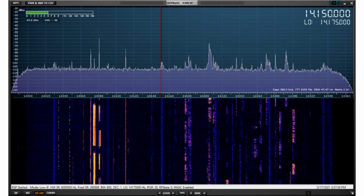Now let's take a band of frequencies. This is the big conceptual leap here, okay? Rather than take a single channel or a single FM channel or a single sideband channel or a single CW channel, we're going to take a group of signals. This happens to show the entire 20-meter band earlier today. These are your digital type stuff over in here. Here are your sideband over here. Here's your CW down here, okay? This is the entire thing.